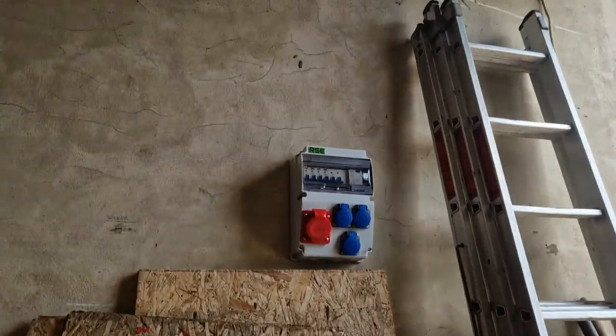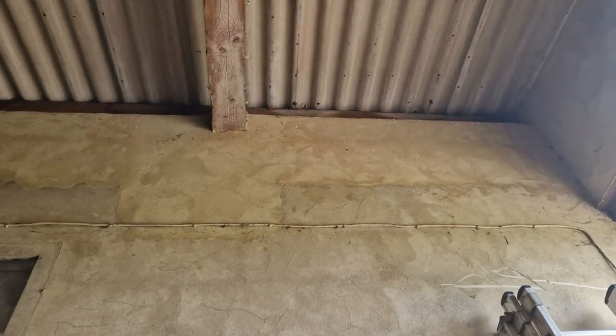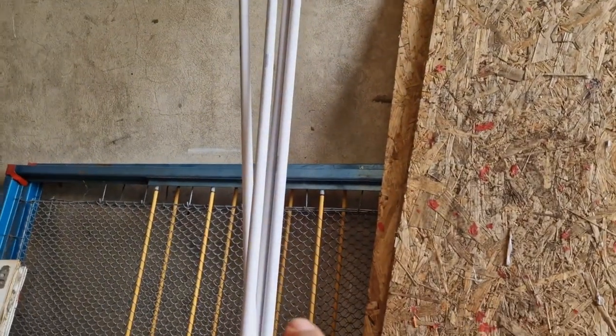So let me get you set up. I'll start marking the wall, because the idea will be mark the wall up and start working our way across this top and getting this cable conduit all mounted up so it can all be pretty. So away we go. To make life easier, we're going to use the laser.